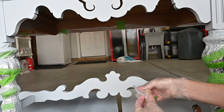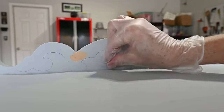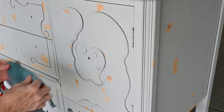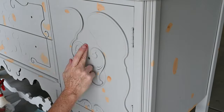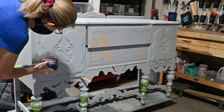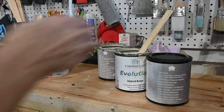Next I'm using Quick Wood to repair the top detail — it had some gouges in the back, so I mixed the two-part epoxy together and filled those spots, and also some little spots on the detail on top. While that dries, I'm caulking some seams I don't like — the seam between the wood and the detail — to give it a more finished look. After the wood filler dries completely I sand those spots smooth, and for areas showing a little more texture I use a two-in-one automotive primer to fill them.